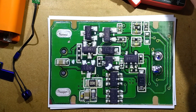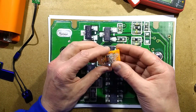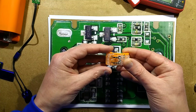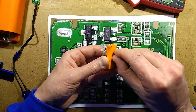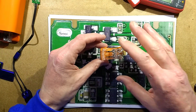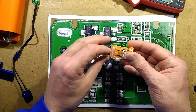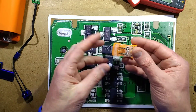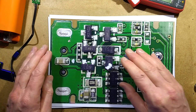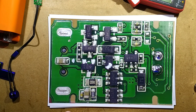Initially when I saw these I thought they were going to be based on something like a cheap thing you can buy for charging old-school phone batteries - like Nokia batteries. It's a universal device with adjustable contacts that slide in and out to match the contact spacing of the battery. You stick it in a USB port and it detects polarity and charges the battery. But it clearly isn't that simple - it's much more complicated. I'd love to trace this circuit out, but the inductor hides so much on the back.